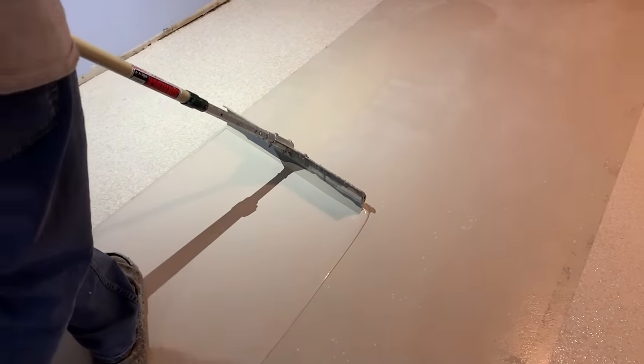If you don't feel comfortable freehanding like this, I would highly recommend taping. The question is what tape can you use that doesn't leave residue on the floor? Now I'm just going to back-roll this whole floor up to here and then I can flake. Be careful how fast you roll — if you roll really fast you're going to shoot splatters up, which will hit your wall or splatter on top of your flake floor. So you don't want to go too fast. As long as you walk flat-footed with spiked shoes you don't leave marks.